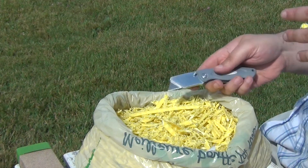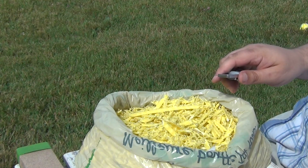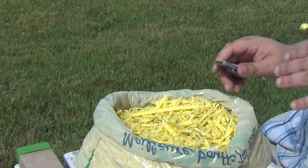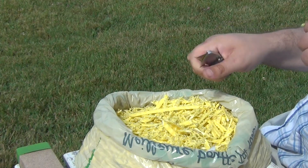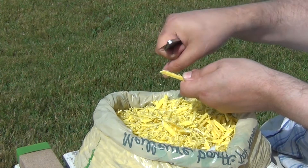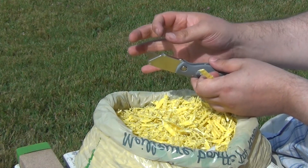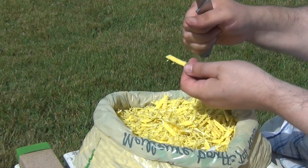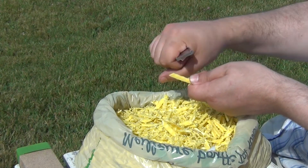Mike Swaim used to do a lot of cutting comparisons on the newsgroup Rec.Knives. One thing he often observed was coarse finishes doing better in areas where you'd think polished edges would perform well. He attributed it to the fact that coarse edges would bite into the material and wouldn't slip, and that biting in made it more stable. Even though you're doing basically a pure push cut, at a very small scale there are always slight twisting motions — the edge is on the size of a micron, so any movement looks huge at that scale. A coarse edge with all those little teeth bites in and has much less tendency to slip and move around.